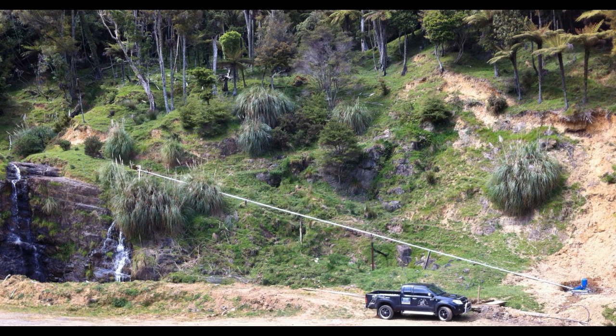Here is an example of a ram pump installation. The surge tank is not very visible but it is right above the waterfall on the left side of the picture, and the water is falling down the diagonal drive pipe into the blue ram pump in the lower right-hand corner. From there the ram pump pressurizes some of that water and sends it way uphill to a storage tank where it is redistributed by gravity — requiring no electricity or gasoline. It is all powered by water pressure.